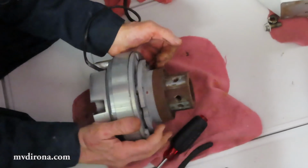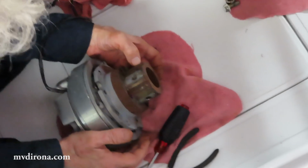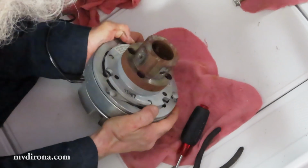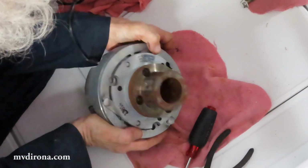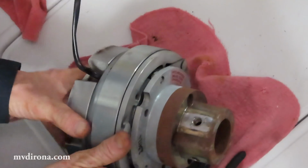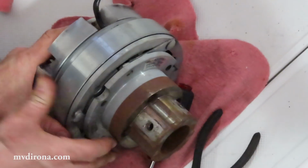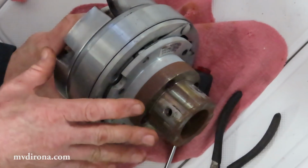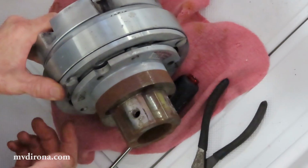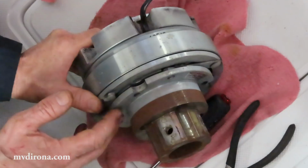And so now we're looking at the final clutch assembly. And that's the same piece that we were just looking at earlier. It is. This particular clutch is made by Pitts Industries in Dallas, Texas. It gives us part number right here. We've got a spare upstairs that we were looking at earlier. What I'm tempted to do is, rather than changing the bearing in this unit, just drop in the new one as it's laid out here, and then change the bearing and whatever parts need to be replaced in the other unit at another time.